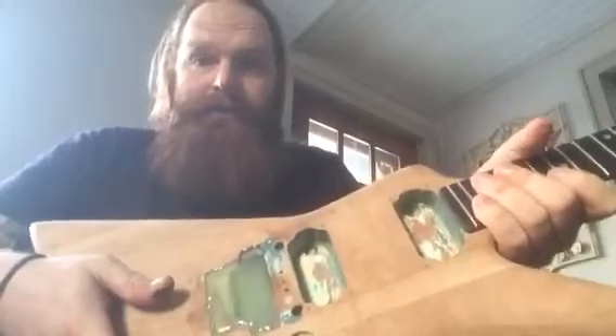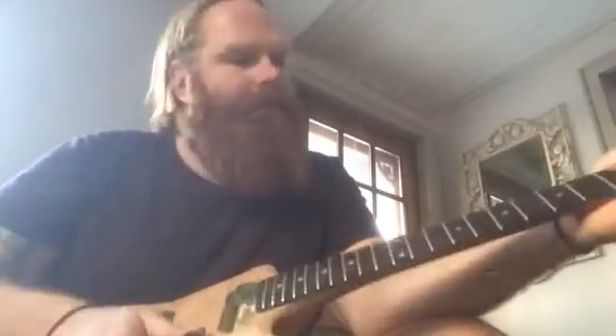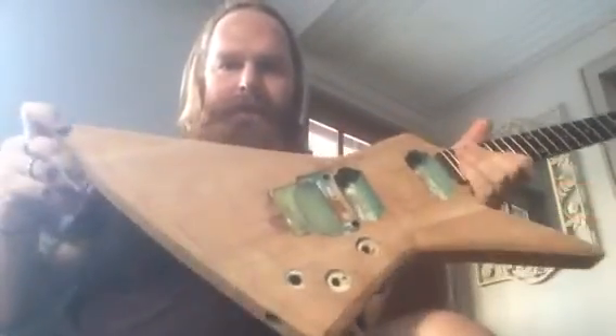If it was one piece or two pieces, I'd just stain it — it's gorgeous. But it would look ugly with these glue lines. So I have some camphor burl laminate I've been trying to figure out what to do with. I think I'm going to laminate the top of the guitar. I've just scribed a pencil line down the center of the body, and I'm going to bookmatch the two halves of the burl. I don't have a big enough piece to do the whole thing, so I'm going to do two halves and bookmatch them so it looks like one.